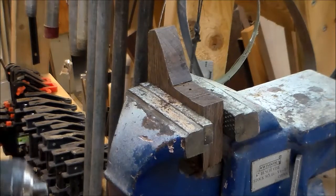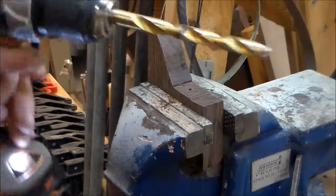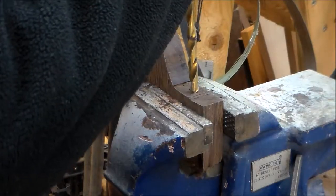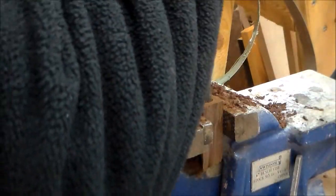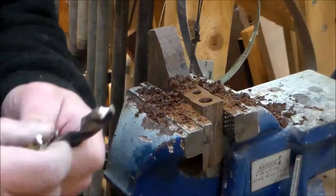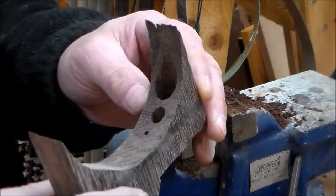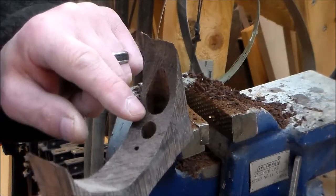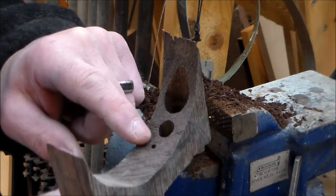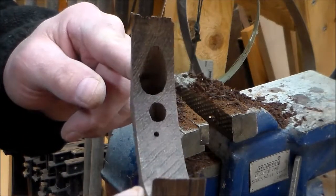Let's go up in size — may have a little more resistance. Okay, one more thing I'll show you: the back side of the wood. A sure sign of a good sharp drill is how it tears out — or doesn't — on the back side. You can see on this super hard wenge that I drilled end grain: no tear-out, a nice clean hole. Super sharp.